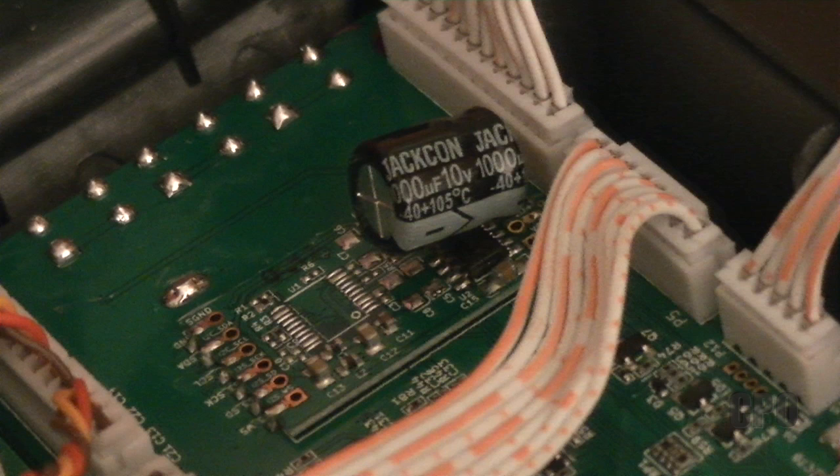It turns out that's a whole other mod. I'm not going to get into that in this video because I want to do a separate video for each mod I do. So this was the 1000 microfarad cap mod to reduce the audio buzz. The next one I'm going to do is going to deal with the volume popping whenever you change the volume control with the Taranis. And the third one is going to address the radio frequency interference issue. So I'm hoping to test them all and see how they work out. That's it for this one — hope you found it helpful. Thanks for watching and I'll catch you on the next one.